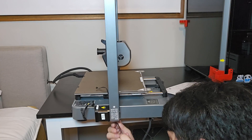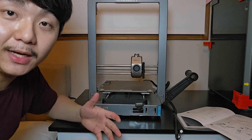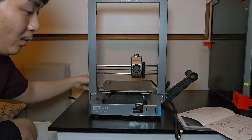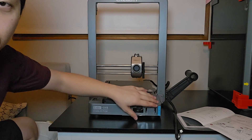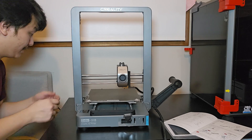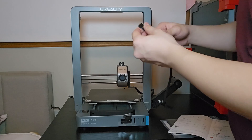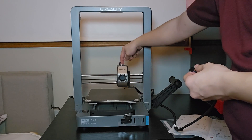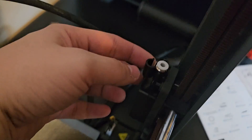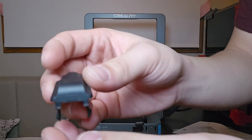The screw took about five minutes — they say it might take just 10 minutes if you know exactly what you're doing. Now we just need to plug in all the wires. The screen has two wires: one for the sensor and one for the motor. This side is the Z motor. The bigger wire hooks up to the nozzle head, which has a holder for the filament runout sensor — you just plug it in.